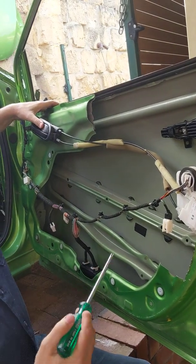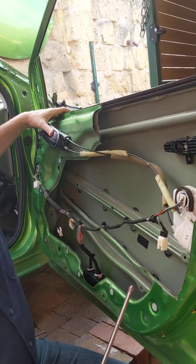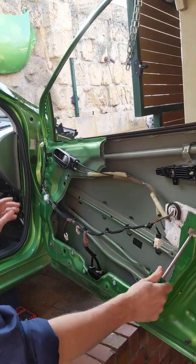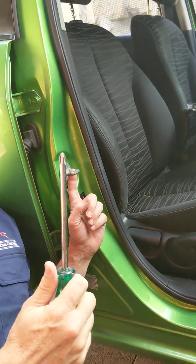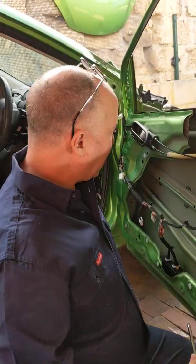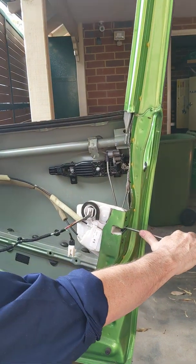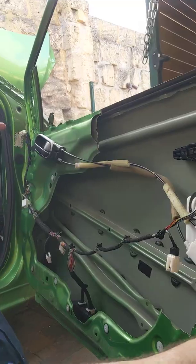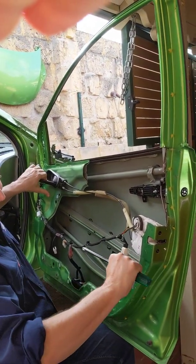Now, because the door's open I actually can't lock it at the moment. If you want to test it, what you can do is use a pretty broad gauge screwdriver to simulate this. Over here you've got the catch for the door, and using the screwdriver I can simulate it. If I push that in, the door at this stage is actually thinking that it's closed. So I can then, by pulling on the lever, open it. So there it's closed and I can't get it out — I pull the lever and I can.